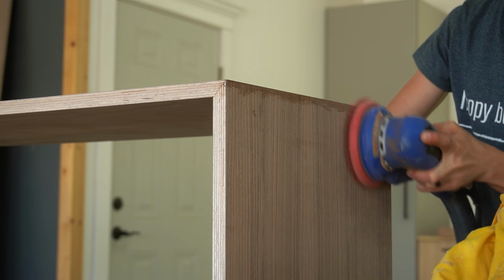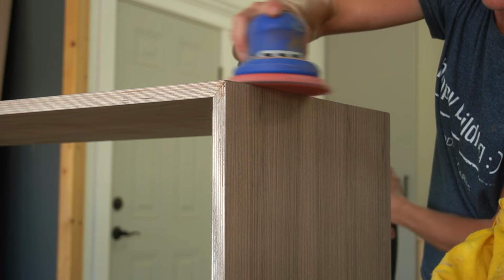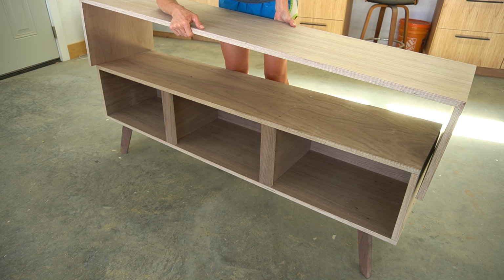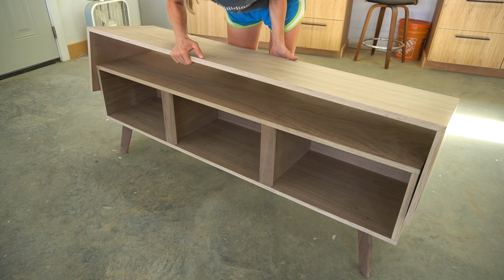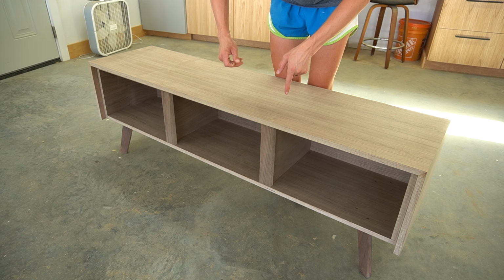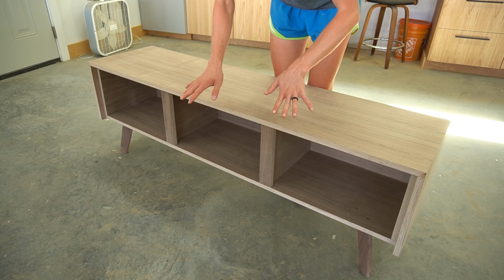I used a little wood glue and sawdust and careful sanding to clean up these mitered corners before adding this piece to the cabinet. Remember me telling you earlier about how I don't glue my stuff? This is a perfect example. I would recommend gluing this piece around the outside. However, because if in the future I want to take this apart, that's going to make it impossible.